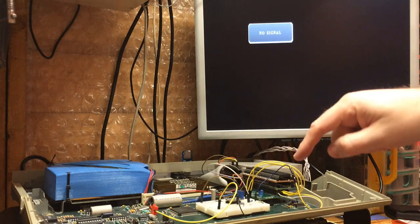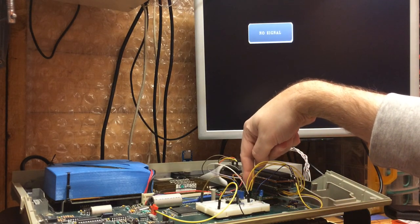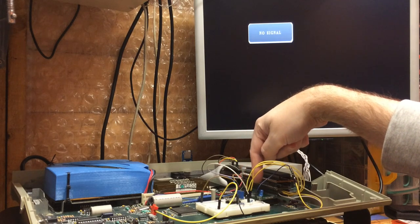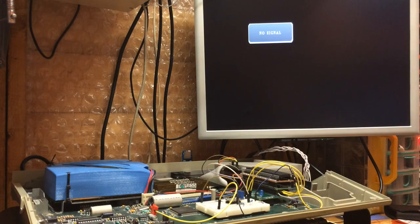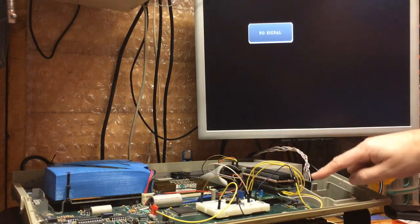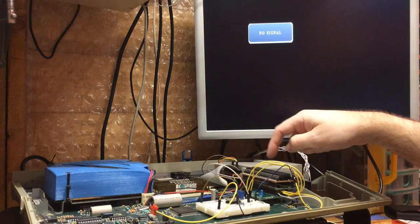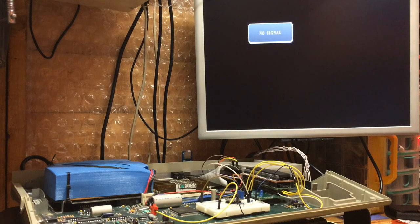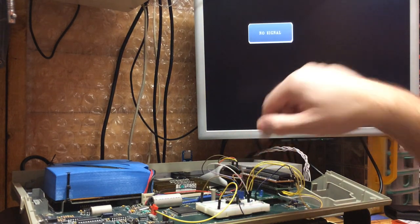This has got a slightly confusing setup here. This is my STE to PLCC adapter. Sorry, PLCC to DIP64 adapter for the STE to let it use plain ST expansions. I've got my board in here. This is a hacked adapter board, and here's a 16 megahertz 68000 sat on top. Coming out here, I've got an external oscillator. This is variable just to allow me to use it.